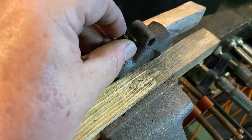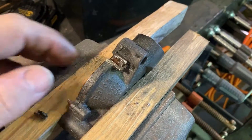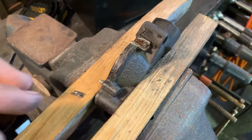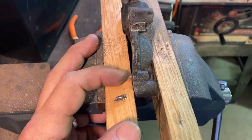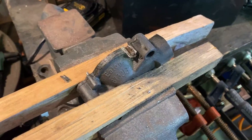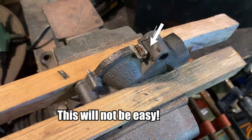Full disclosure, guys — I really knew I was screwed as soon as the extractor busted off in the hole. That's what I had to do to get that out of there. I really feel for you guys having those bust off. I've got one more to come out — I still have a little peg showing, but I've put vice grips on it and everything else and it still will not come out. I heated it up, I put PB Blaster on it, and it is still fighting me. Wish me luck — hopefully it doesn't turn out like that one did.